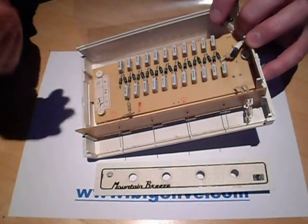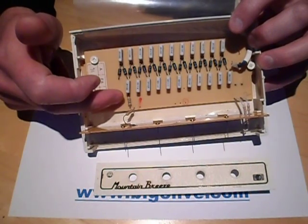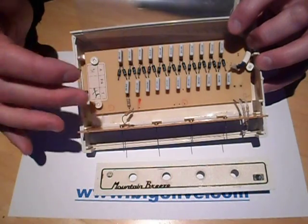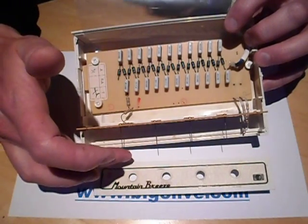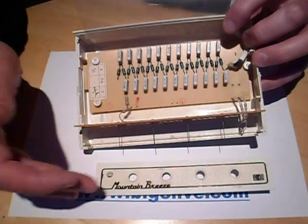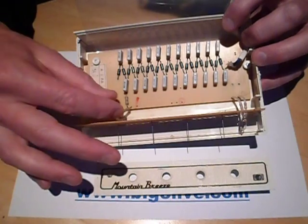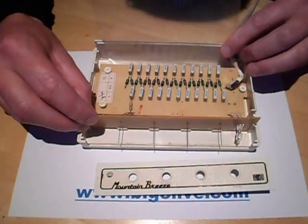The voltage has been stepped up and then it goes via these two resistors. They're safety resistors — 2 at 10 megohms. The reason for that is the ionization current is super low, really very low — must be like microamps or even nanoamps. If you were to touch the needle, that's basically between you and the mains via those resistors. Although the voltage is several thousand volts, as soon as your finger approaches, because you're a fairly good reference to ground, the actual voltage will fall on the multiplier to an extremely low level, and it won't exceed the voltage rating of these resistors or cause them to flash over in any way.